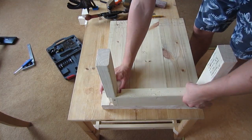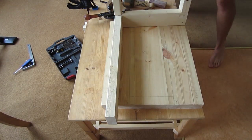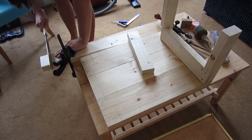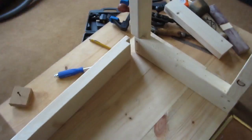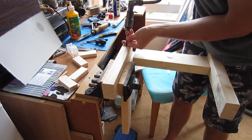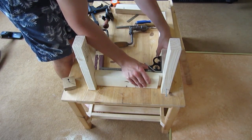I'm also trying to match up as I go along all the pieces to my drawing I made, which isn't 100% accurate but it kind of gives me more or less an idea of where everything needs to be. The benefit of doing it this way is that I can actually place pieces where I kind of want them and then make my cuts according to how I need them — basically making them fit together rather than trying to cut them out pre-build and then find out that they don't work or they don't fit together. This is the joint that went slightly wrong — this was going to be a flush joint just screwed in place but instead I ended up with this weird half rabbit half lap joint thing.